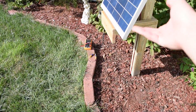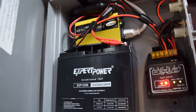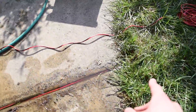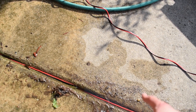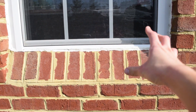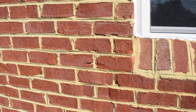I've begun routing the cable to the solar setup inside — the charge controller, inverter, battery, etc. I've taken the cable from here, run it under the mulch, and used a shovel to cut the roots of the sod, pulled that up and stuck the cable under there. The cable travels along here and all the way to the corner. I cut out a crevice there with a screwdriver, got the dirt out, and stuck the cable in. I'll put dirt on top to protect it, then run the rest up through the window to the solar setup inside.